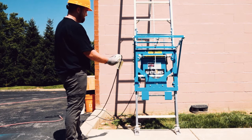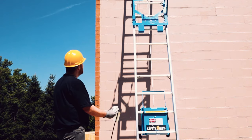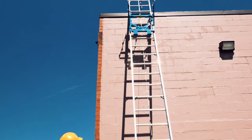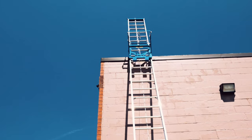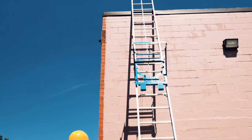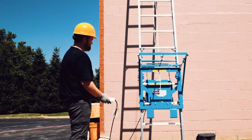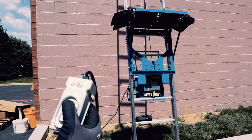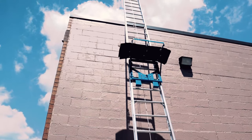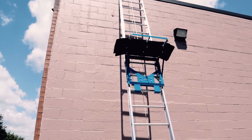You are now ready to do a trial run. Press the up button on the pendant controller to lift the carriage up and press the down button to lower the carriage. As soon as the carriage hits the top or the bottom, be sure to remove your finger from the button to avoid cable crossover. If cable crossover does occur, correct it immediately. If cable crossover is not corrected, you risk cable damage or failure on future runs. You may now begin to use your hoist. Lower the carriage to the desired position and begin loading your supplies. Make sure you are inspecting your winch drum and cable during each run — crossovers must be corrected.